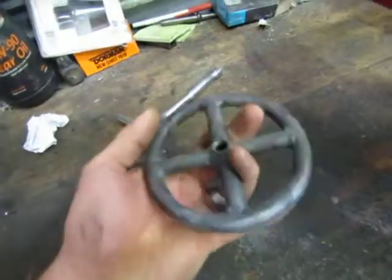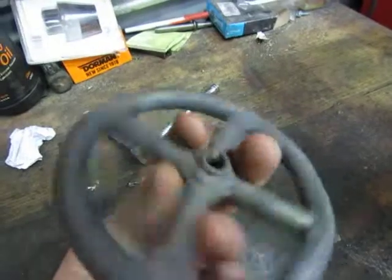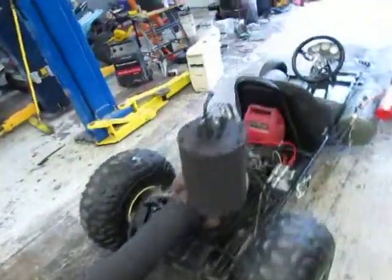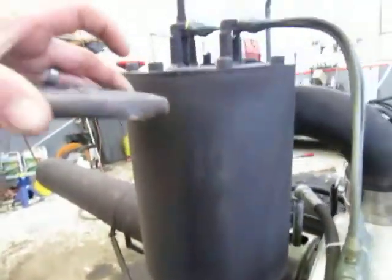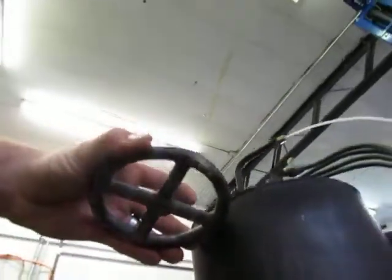But yeah, that's how I had it made. I had a little closed nipple on the top of my combustor cap where I just screwed this on basically, and these holes would face down the combustion chamber into the turbine. Before I converted my engine over to diesel, that plug right there is where this injector ring went, and it sat just like this inside the combustor with the holes facing down.